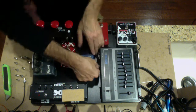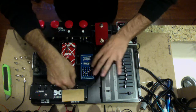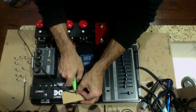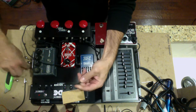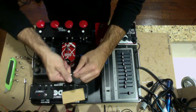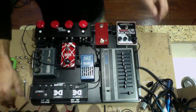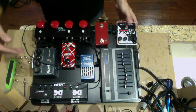And then I'm going to run this cable and dress it out to where I want it to be. We're going into this 9 volt tap right here. So right about there is where I want to clip it. So I take my blade, just chop it like so, grab myself another connector here, and just screw it on. And there you go. We're going to plug it in and just give it a quick test. And as you can see, the memory board's lighting up, so we're good to go. Turn off the power supply.